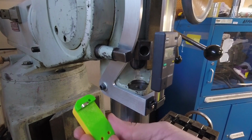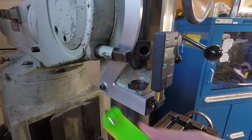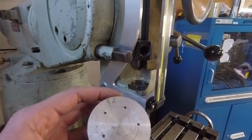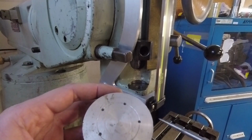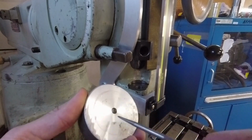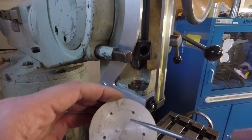So we'll go ahead and make a piece like this out of aluminum. So this is the piece of stock I found. That hole actually will be utilized. That one will be milled off below the surface, and there'll be two new holes down here. There is that hole, however, but that'll be on the back side. So I might even mill out a pocket within that just to lighten this bracket up a little bit.